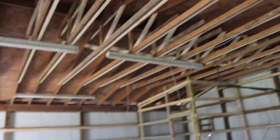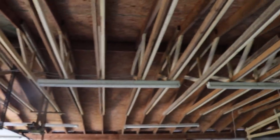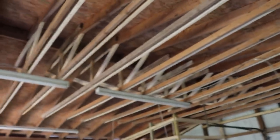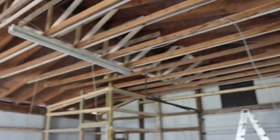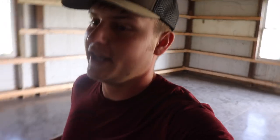We're redoing everything. We got all the rafters done — all the way back through. I reinforced every single truss that was in here. I'm sorry if I'm getting the terminology wrong — they were kind of built like stick-built home rafters, but I tried to make them into the closest thing I could doing it DIY to make a stronger truss. Everybody that's seen it so far says it's way better than what it was and it's going to be way strong enough. I also got all the windows sealed off with seal foam around all the windows and all the gaps.